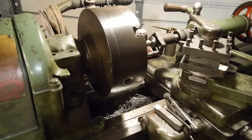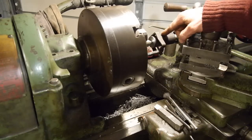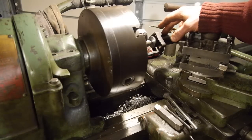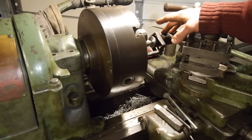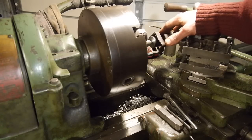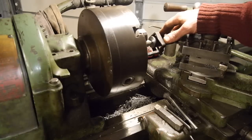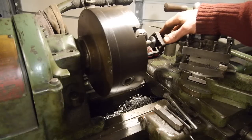I got a little makeshift dog here. I'm going to turn this down to three-quarters - three-quarters works because my mill takes 40 taper and I have very little tool-holding capability. I've got ER40 and ER32 collet holders, they both will hold three-quarters. Ideally I'd like a thicker shank for this, but then I can use whatever's in there. I also have one three-quarter-inch tool holder but that's NMTB40, not the CAT40 that I'm using with the drawbar installed currently.